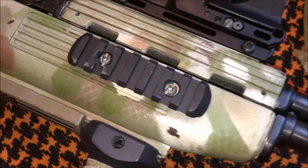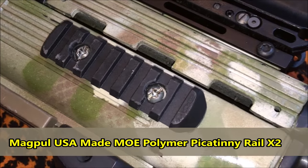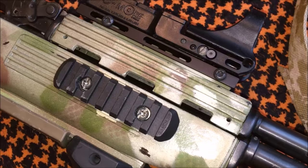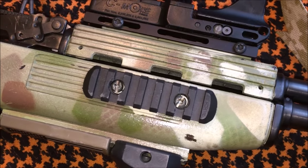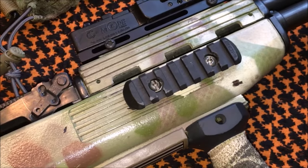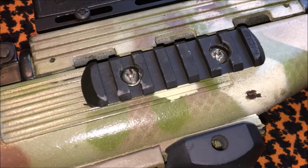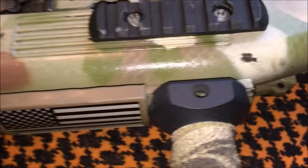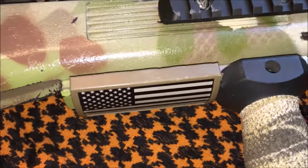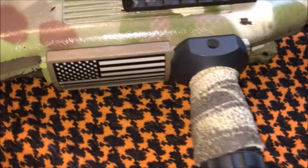Something I didn't mention yet is the Picatinny rail — this is an added-on modification I did on both sides. This side used to have a flashlight but I took it off because of the added weight on the forward end of the rifle. Installation was fairly simple — I just tapped the frame of the stock with a drill and bolted the Picatinny rail in. I also have a custom gun rail I got at Shot Show 2015 that provides a comfortable grip covering the Picatinny rail on the Tapco stock system.